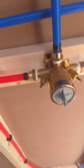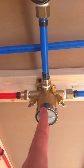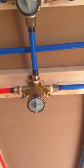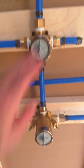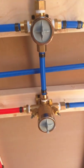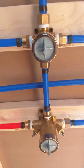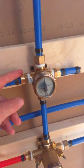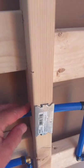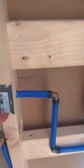So you'll notice this is the blank cap for the rough end. I turn this vertically, and then turn this one vertically as well. I run a laser on my tripod and align this one with that one — there's a little snub over here, mark it with a pencil, and just screw it in. I love my laser level; it's so convenient. You can be a quarter inch off — it's not a big deal, but aesthetically if it's off it looks sad. So we put a 90-degree elbow through there. I like my nail plates — they help prevent nail penetration. We'll squeeze one in and then do the 90.